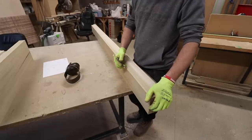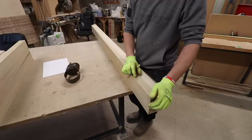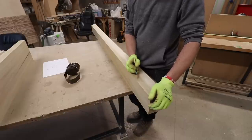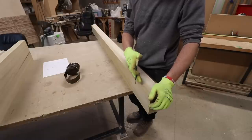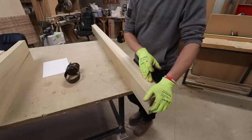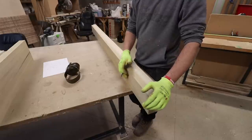So I'm going to go with an 18mm panel thickness, and I think I'm going to offset it very slightly in the door. So one side's got a narrower panel ledge, so it'd be about 13mm from the face to the 18mm panel, then it'd be 18mm panel, and the back edge of the door will have a slightly deeper gap to that panel.